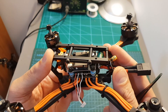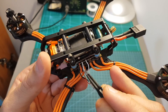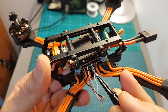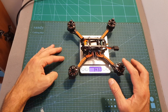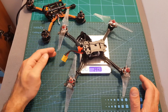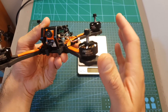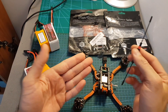Since this is a plug and play quadcopter you need to provide your own receiver. I pre-configured mine to work with SBUS. They've already soldered a connector for you — ground, plus five volts, RX1, and TX4. It also supports PPM via a dedicated pad, and provides 3.3 volts out for receivers that need low voltage like DSMX. In terms of weight, even without propellers, VTX antenna, and receiver, the GTM 540 weighs 343 grams — heavier than my Hawk 5 at 295 grams, largely due to the 2308 motors which alone weigh around 140 grams.